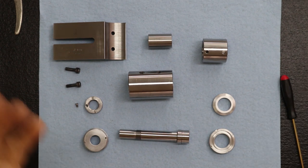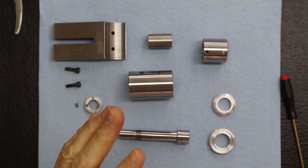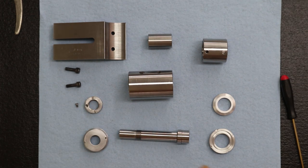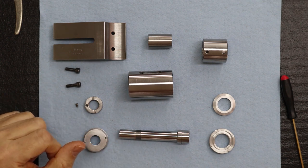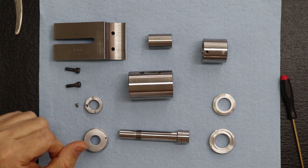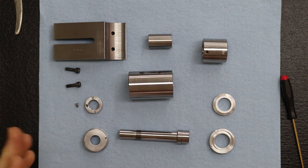The reason why we don't recommend cleaning bearings, even in this case, is because if you put the bearings under, say, a high power microscope, you'll notice that the bearings are corroded, they're pitted. It's just due to age and just sitting. You just don't want to do that. If you're going to go through all this effort, buy brand new bearings and do it correct.